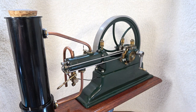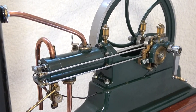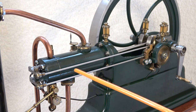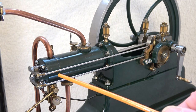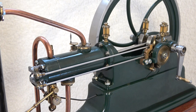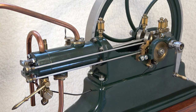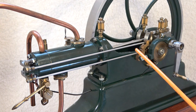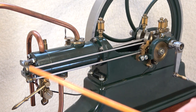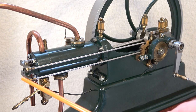For example, the Crossley engine had a side shaft connected by means of helical gear wheels to the crankshaft, and operated the valves and the flyball governor at this end. I was not able at that time to make helical gear wheels, so I made two straight teeth gear wheels and arranged long push rods to operate the exhaust and intake valves by means of two rocker arms.